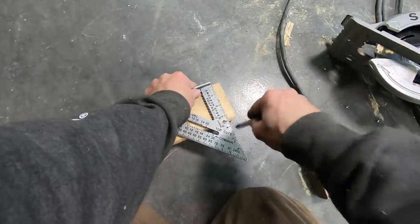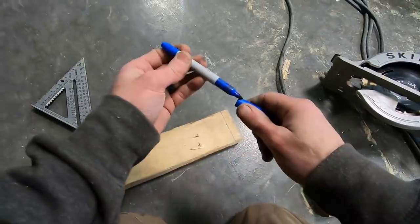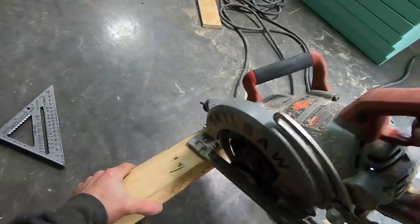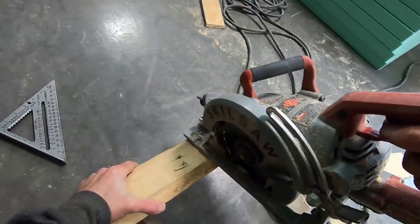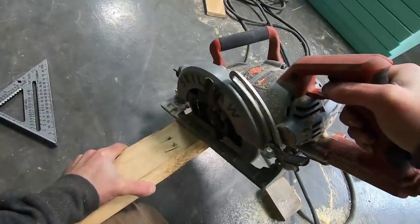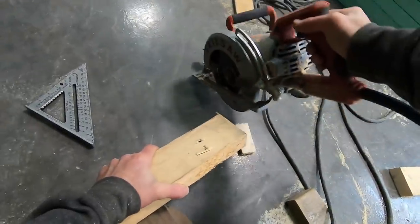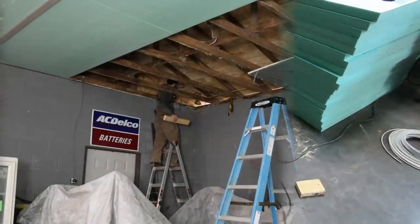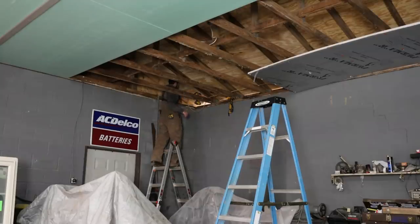So on a building like this, in between each truss where it's sitting on top of the wall, that gap is filled with two-by-fours that are set in place. They're not tightly fitted, they're nailed, and that's it. It's a huge area where air can get into the building, and all I'm doing is repairing some of the ones that I had to remove when I extended the overhangs on this roof, tightening them up a bit, and spray foaming around every one in order to make this place not so drafty. I don't know what you would really do otherwise. Maybe stuff some insulation in there, but spray foam in this situation is your friend.